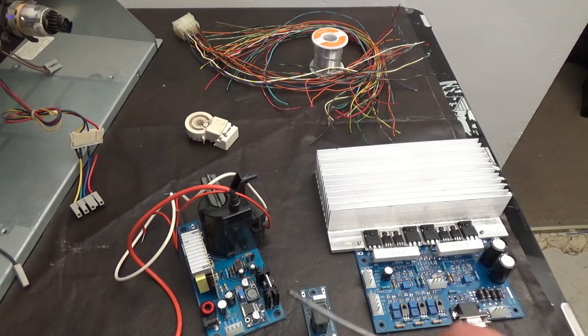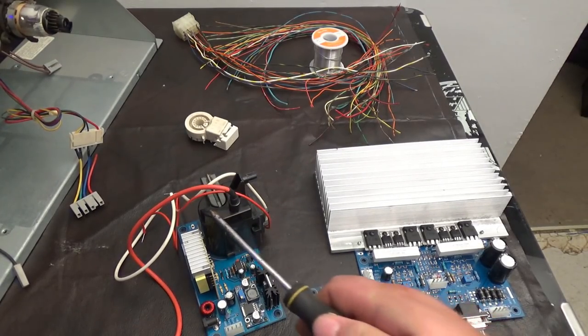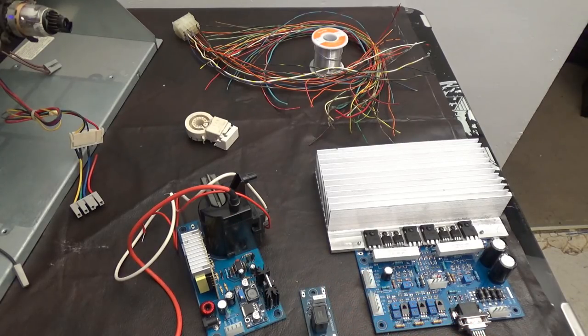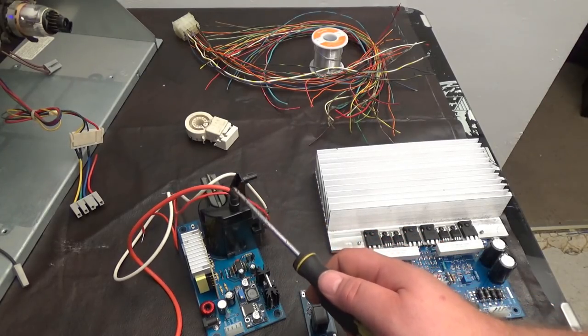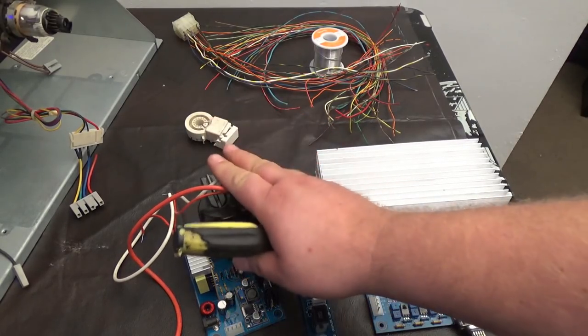Revision 2 and Revision 1 were the exact same high-voltage board. In my opinion, the flyback was undersized — I believe it saturated a little too early. It would be great for 19-inch tubes, but anything over 19 inches, it might be pushing it. I believe this can run a larger tube with more ease. So the biggest thing, my favorite thing, was the larger flyback.